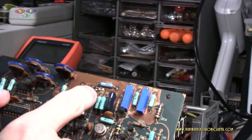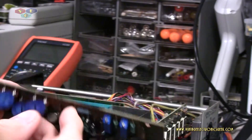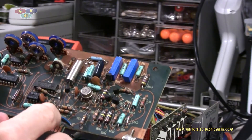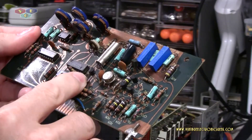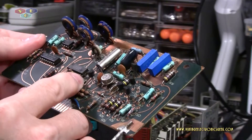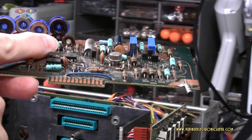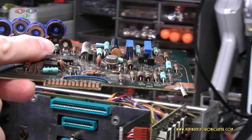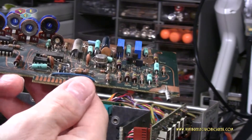This wire that's coming through the board is not connected to anything on the other side. There's a splotch of solder dripped right here in front of the IC, going over two traces. And this trimmer cap where my finger's pointing — these two legs here are soldered together, so I don't think that's doing a very good job.